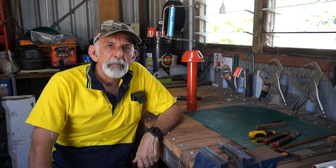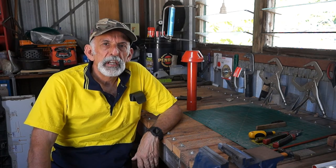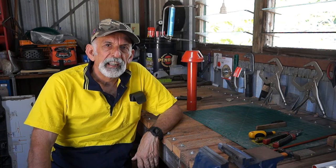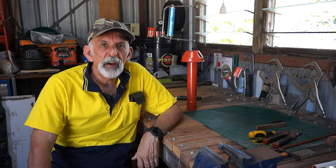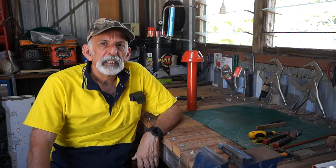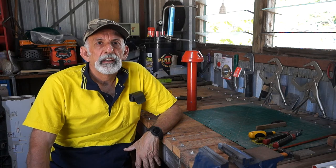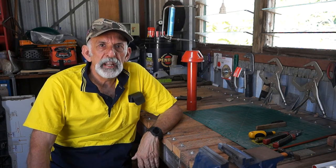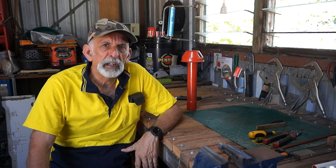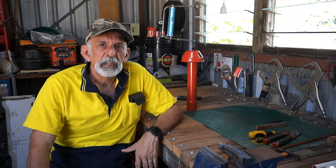So there you have it, we've finished the video. You just saw a few videos and pics of me cleaning the elements of the air cleaner system. I was using kerosene this time. It's going to stay out in the sun and leave it overnight, and tomorrow I'll hit it with compressed air. I hinted to you in a couple of photos what that's all about, and we'll see how it goes.